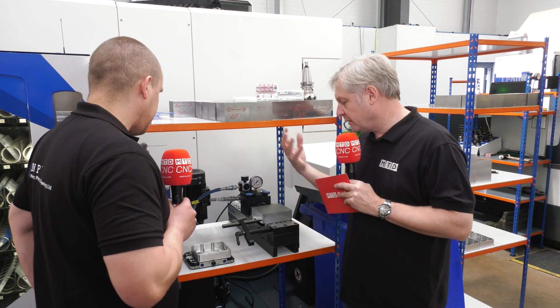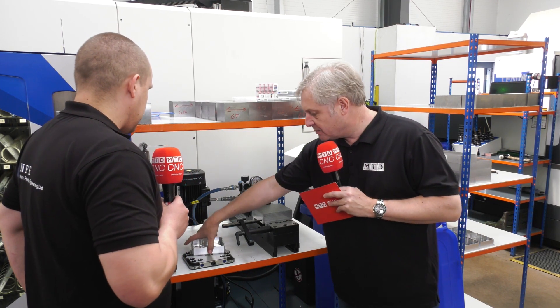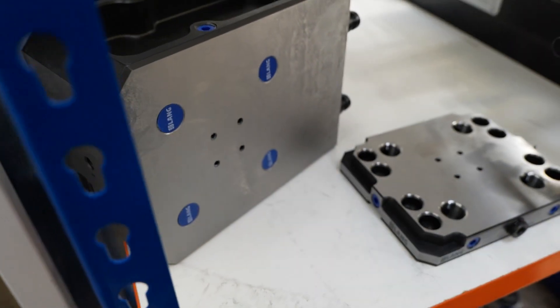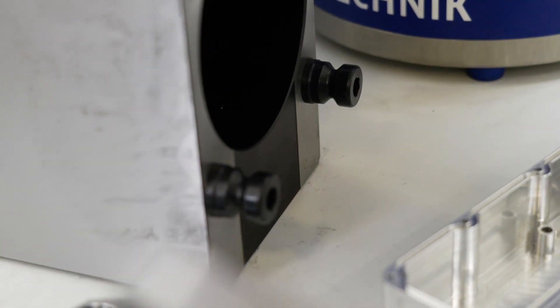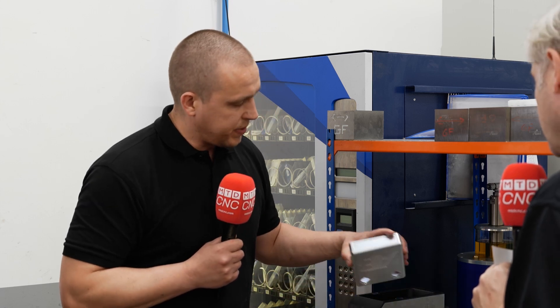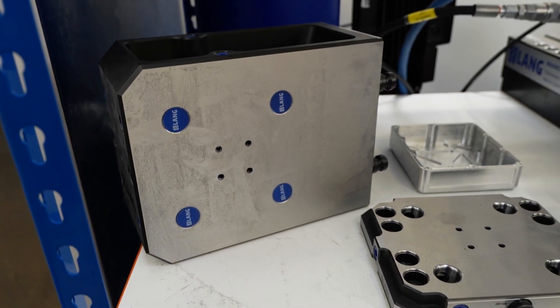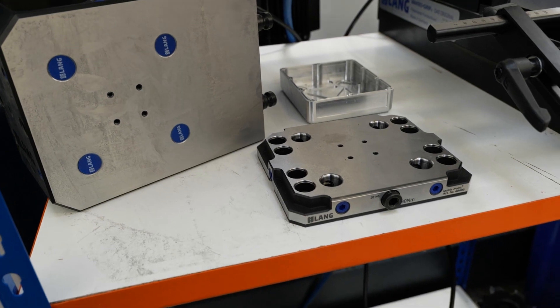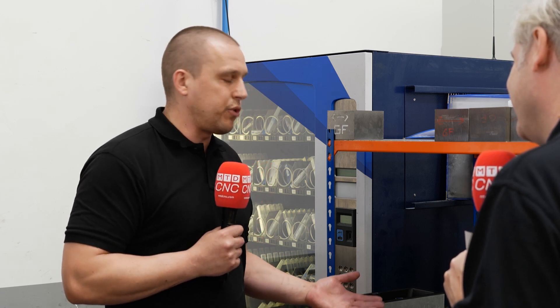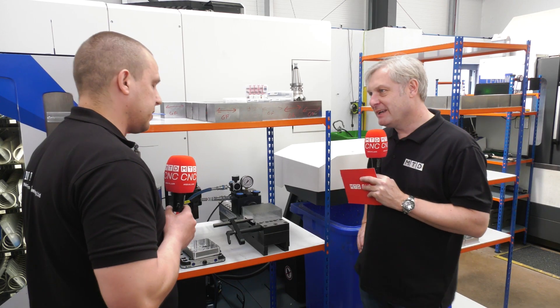Very quickly though — it's a modular system. So you've got your vise, zero point system, vise into here, but also — what's this here? This is a 90-degree tower, so that locates on a zero point and then with a vise, the vise can go this way, that way, or any 90-degree orientation, which means we can produce a part with a finish on the side and then on the other one as well. Pretty much, we can put the vise in there, clamp it, unclamp it, put it all the way around, clamp it, done. It's giving you a lot of flexibility. It's our easier way to get a four-axis machine, because we don't really have four-axis work that much, but for something like a three-plus-two machine, that's perfect.